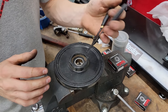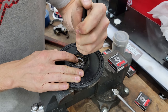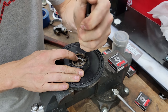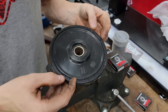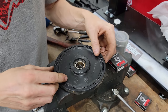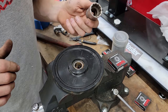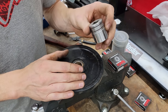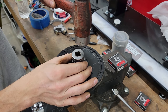Step one: use your snap ring pliers and carefully remove the snap ring. Flip the bogey wheel over so that the wider side is down — you can only take them in and out one way. When your kit doesn't have the right sized seal or bearing driver, grab a 12-point socket that you don't much like and hammer the bearing out.